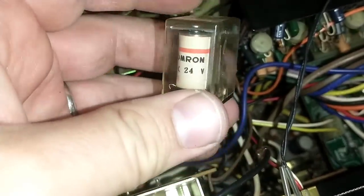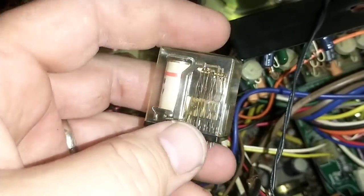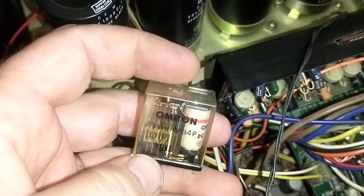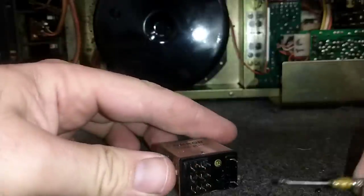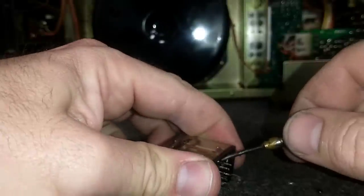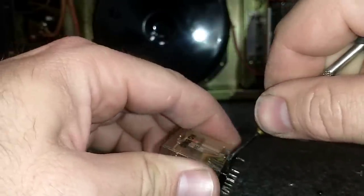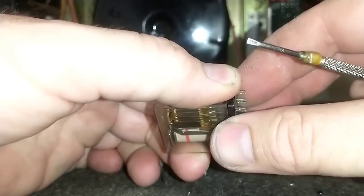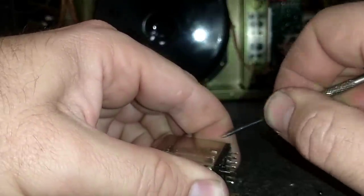This is an MH4P relay. You can see there's a lot of contact actuators in there, and all those little contacts get touchy. So let's take it apart. Probably the best way to demonstrate this is to get a tiny little jeweler's screwdriver. Your goal is to try to slide it underneath here without stabbing yourself or the coil, and pry up past the latch like that. Pinch the sides so that it doesn't fall back over the hook again and latch itself. It usually takes a couple of tries.